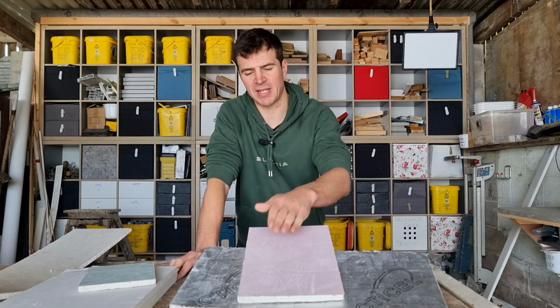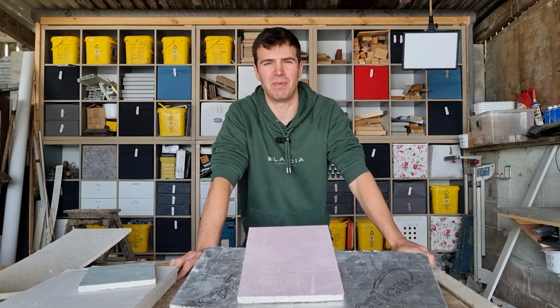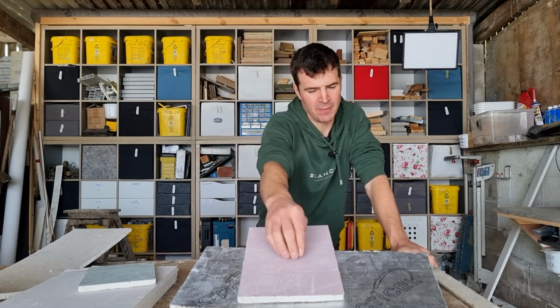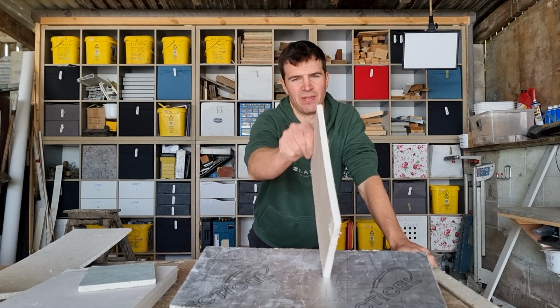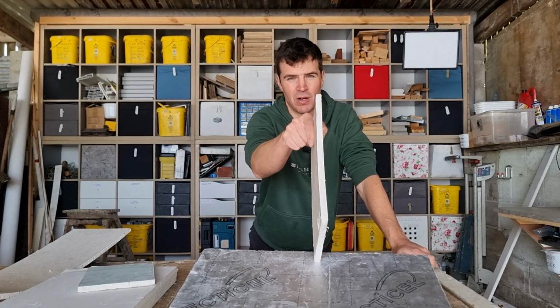So always make sure your plasterboard screws are flush with the paper, maybe down a millimeter, but nothing more than that, so that your screws are actually holding the plasterboard to the wall by the paper. There's no strength in the gypsum in between the plasterboard, as it's just made of ground up rocks.